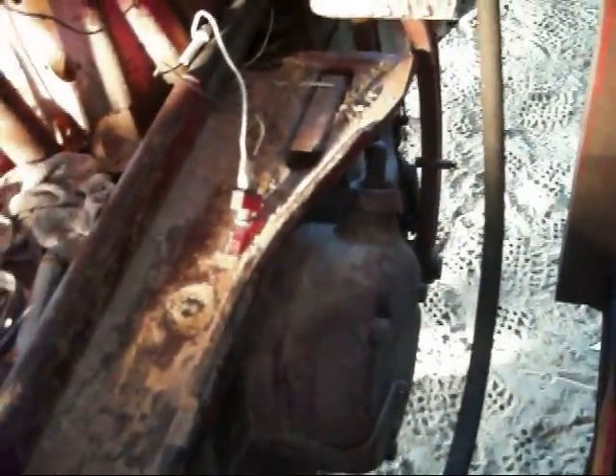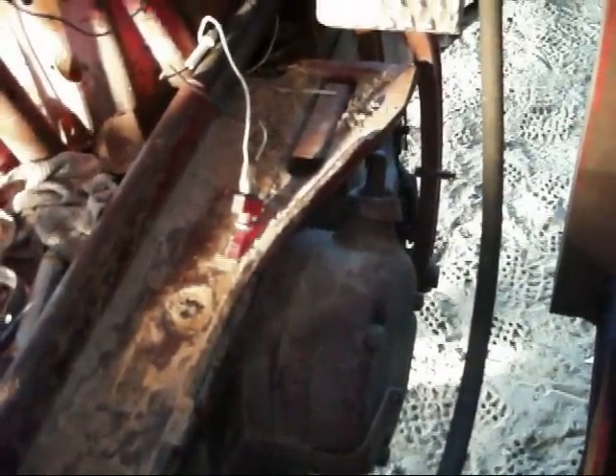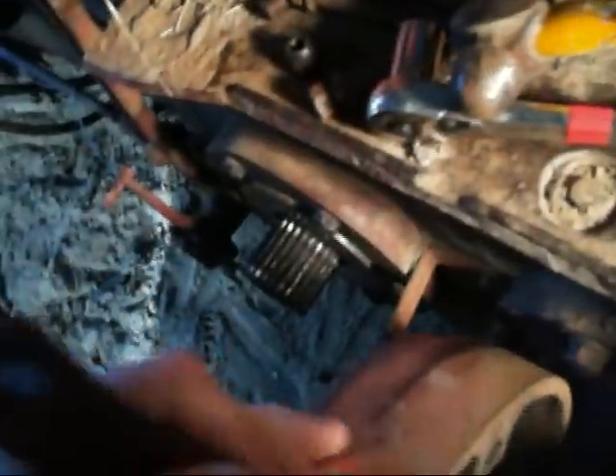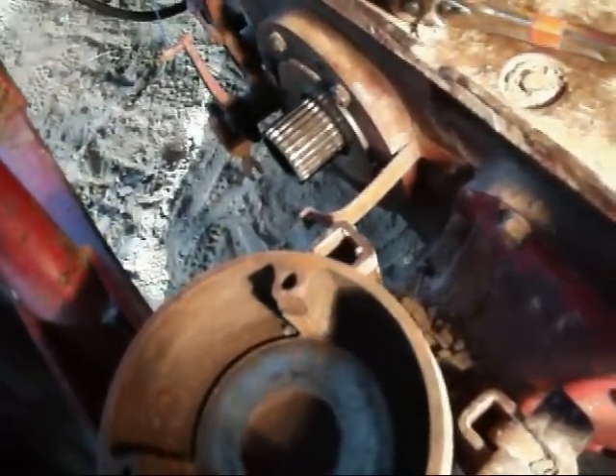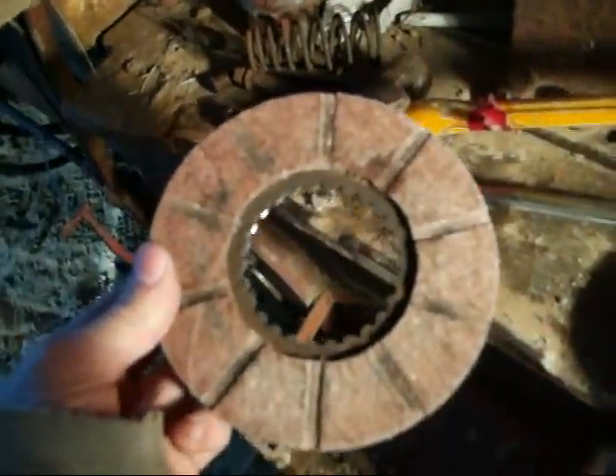They never have been very good, so I went and got new brake discs for it. There are two brake discs aside for a total of four. I got this side off, and then I had my new brake discs, and something's different here — because they have a 12-spline, 6½-inch outer diameter. Mine are a 24-spline, 6-inch outer diameter.